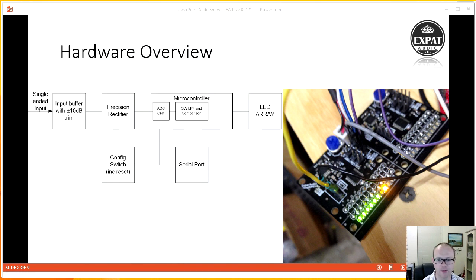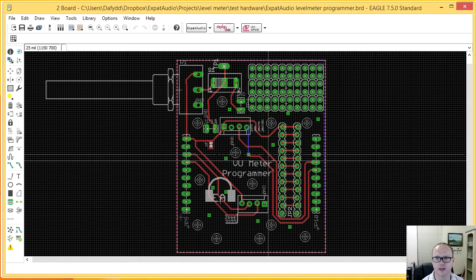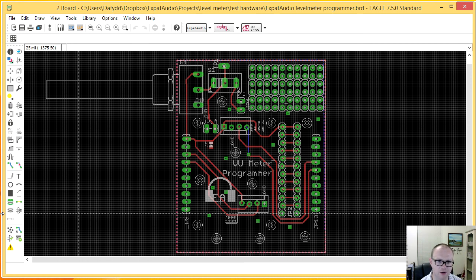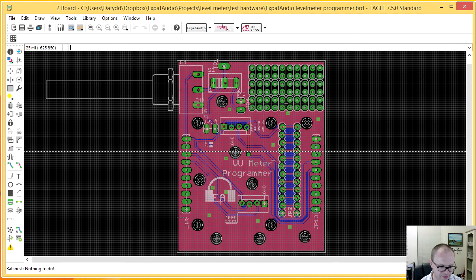Now to emulate that ribbon cable, you can see it here. Here's one pin array and here's the other. And so I tie the signals across. And this is my virtual ribbon cable, if you will. It also means I can test the board and not modify the board while I'm testing it. And then these two pins here are actually ground, because in Eagle I can flow all the ground with one button.